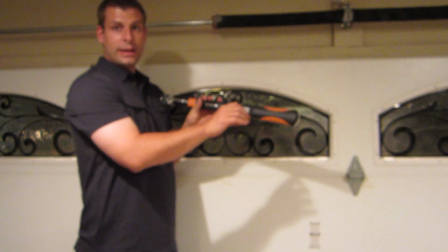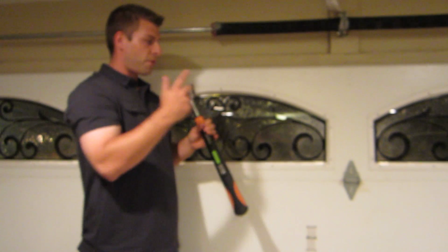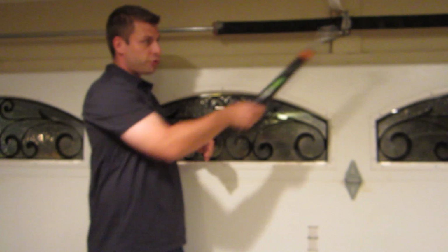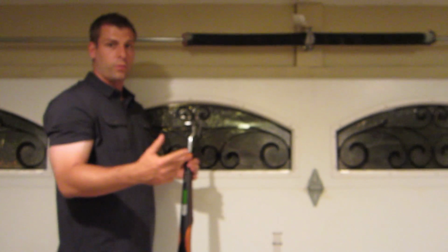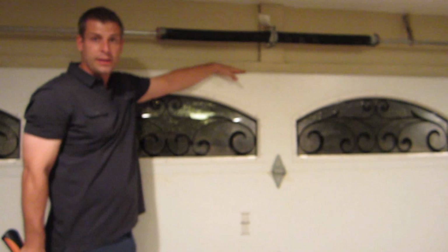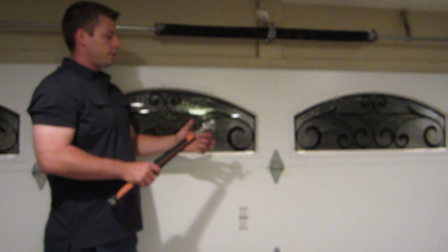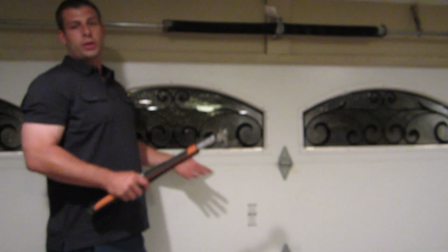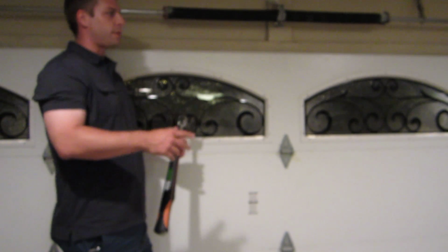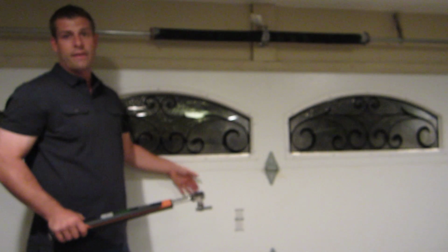That 33 is going to be evaluated on three factors, two main ones. The first factor is the drum size, which is 4 inches, that will be the default. And then you got the height of the door, which is 7 feet, because you could have the same IPPT on a 7 foot or 8 foot. So you want to make sure that it knows how many turns are on it. And then the third thing is the radius of the track, which isn't as big a factor.